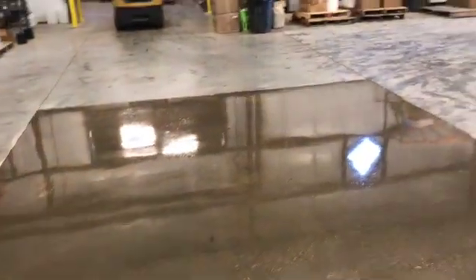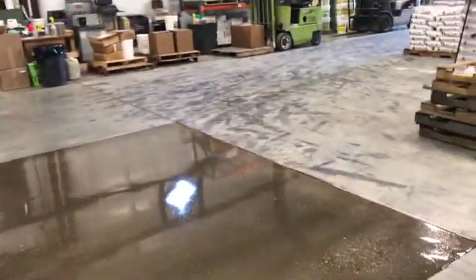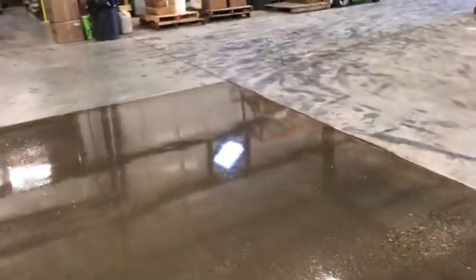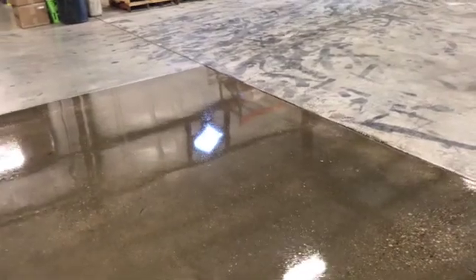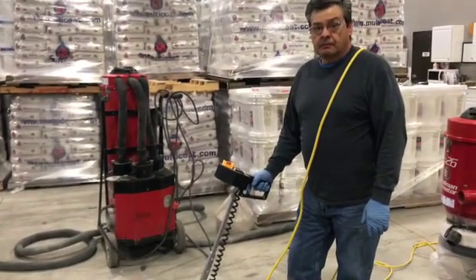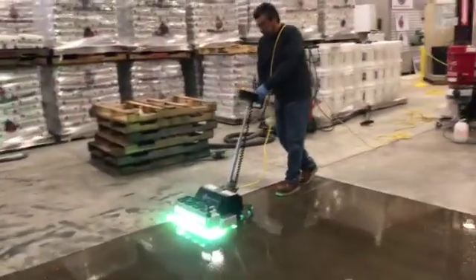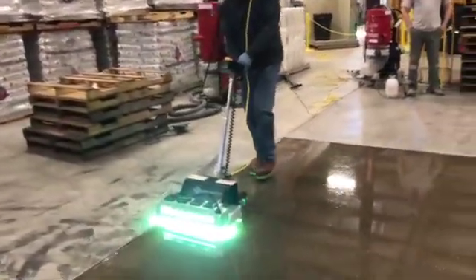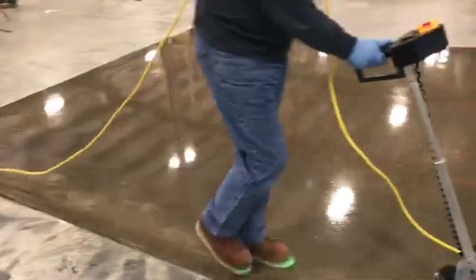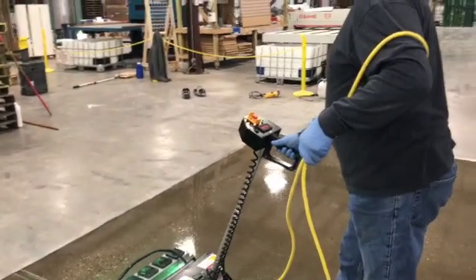We've got this product applied — took about 10 to 15 minutes and let it sit out another four or five. Keep in mind that this is as wet now as when you applied it and will be wet tomorrow if we do not put this light on. But as soon as we put this light on, you can walk on it in normal shoes because behind the light you're fully cured already. At this pace we will fully cure 150 square feet in less than 10 minutes.